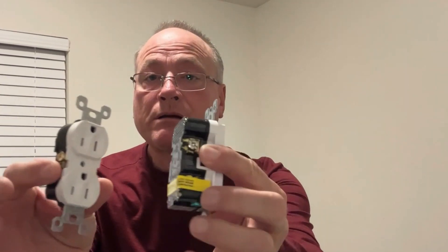So what's the big deal about a GFCI? Well, they're quite a bit bigger than a standard receptacle because there's some really smart electronics inside. These electronics monitor the current running through the receptacle and shut off power if they detect what's called a ground fault — that's when electricity is leaking through a path that is not intended, such as through a person or water. They shut off the electricity immediately to protect that person from shock or possible electrocution.